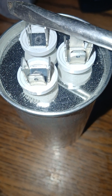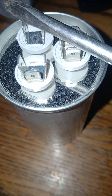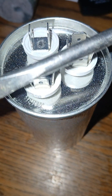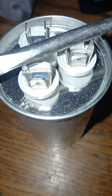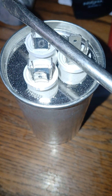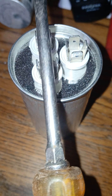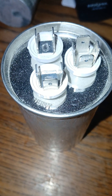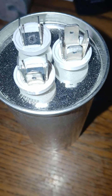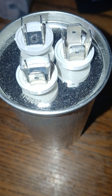To prevent getting shocked, first do not touch the terminals. Second, take a screwdriver and cross it over from one terminal to the other to discharge it. Once you discharge the capacitor by touching the prongs together after it's been unplugged, this discharges the stored energy and makes it somewhat safer to handle — though touching the terminals is still not recommended after use or at any time.